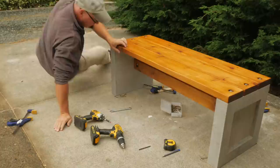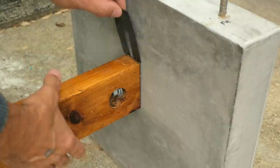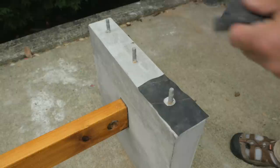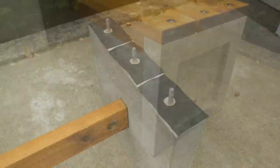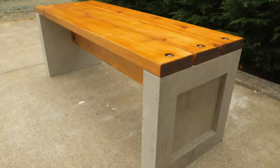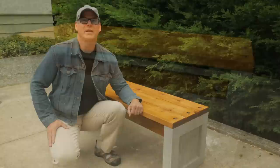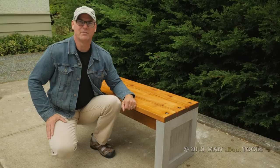I forgot to add rubber gaskets to keep any wood from contact with concrete — wood will wick moisture from concrete and cause rot, so a rubber gasket will help prevent this. I used an old tire inner tube and cut the gaskets with scissors. When I move this bench out to the garden, I'll add the rubber gaskets then. Thank you so much for watching. If you like what you see on our channel, give us a thumbs up and hit subscribe if you haven't done so already. We'll see you next time.